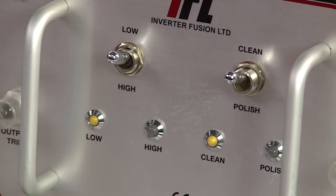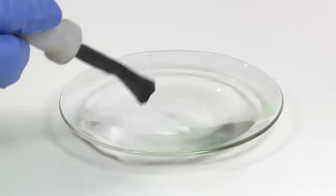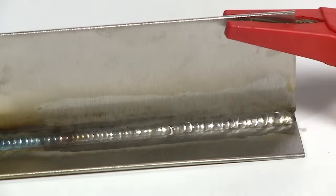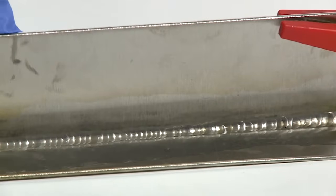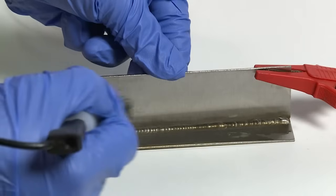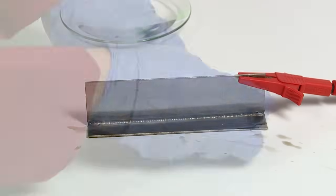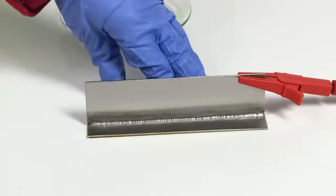The relevant LEDs will light up. Dip the brush into the cleaning fluid and gently brush it along the weld joint to remove the discoloration. The action should be a brushing movement similar to painting rather than a jabbing or grinding motion. Some sparking may occur during this process — this is normal and harmless. Once the joint is cleaned, spray with water and wipe off using a clean cloth. Rinse the brush with water to remove any residual fluid.